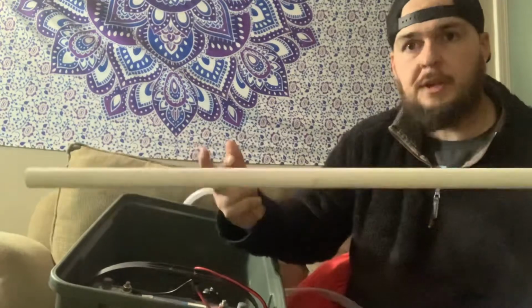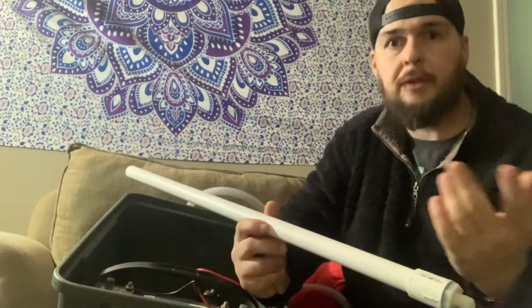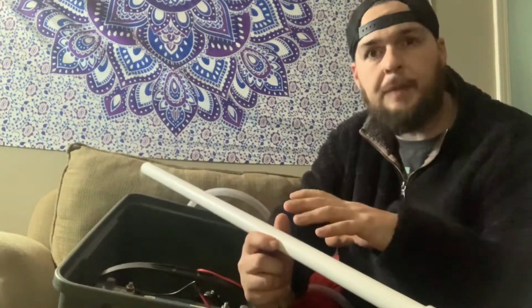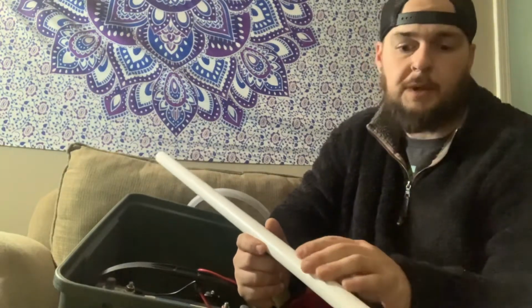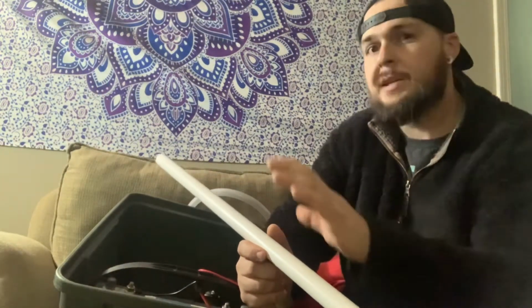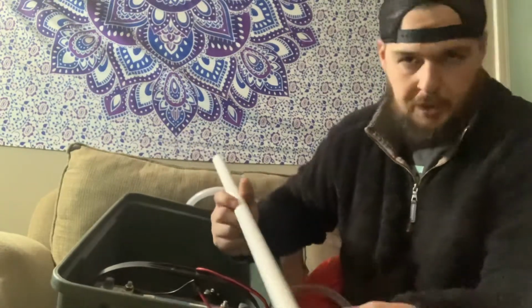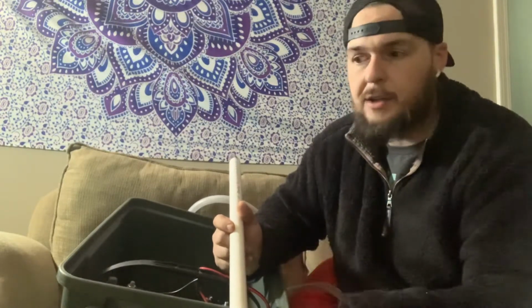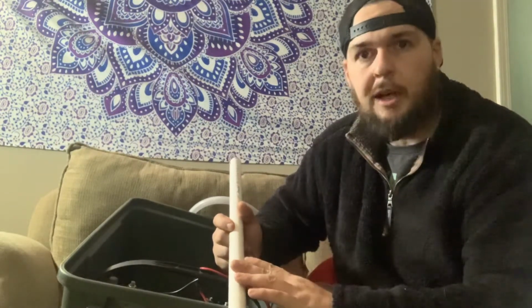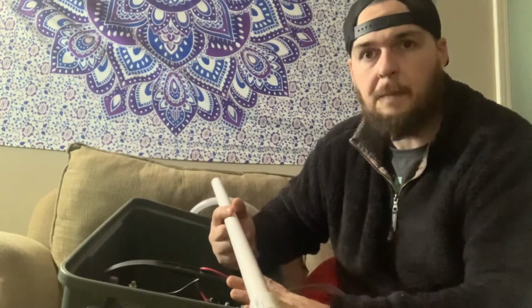Again, I have a batch mix system, so I've got a 100-gallon tank that I usually fill up. I usually put about 30 or so gallons of chemical at a time in my 100 gallons, and then I dilute with water down to what I need. If I have roof washes, I start those out first in the day and work my way down, and I just do the math and figure it out over the whole day. It'll be a lot better when I get my proportioner put on, but I've got to get a couple more tanks and all that good stuff. For the time being, this has been working out pretty well for me. It has for the past few months. This setup has made me a lot of money.